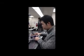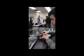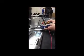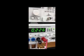Here is the sensor of our car. If the sensor is testing black, the voltage here is almost 4 volts, and if it is testing white, then the voltage becomes really low, maybe just 0.2 or 0.3. So that's how we can tell if it's black or white.